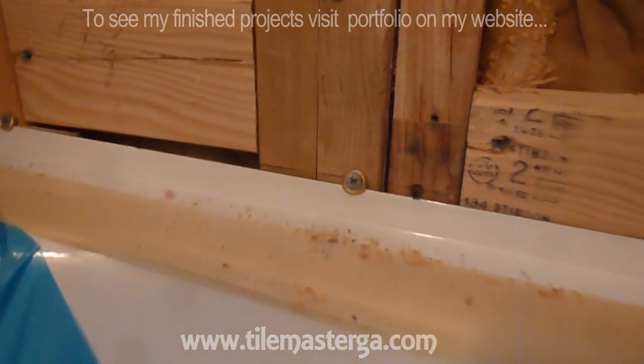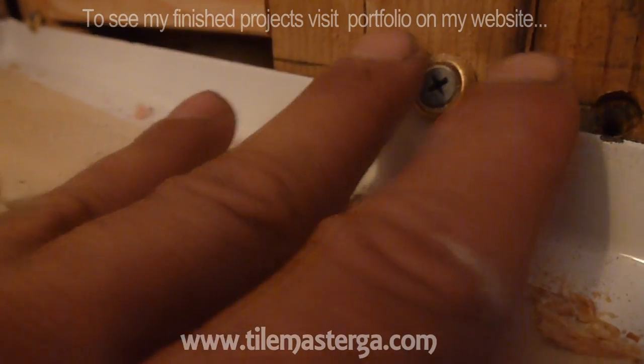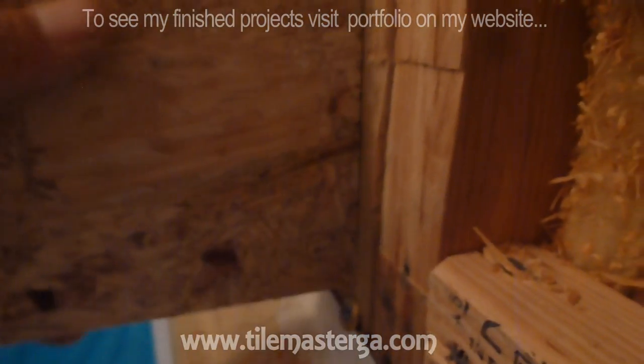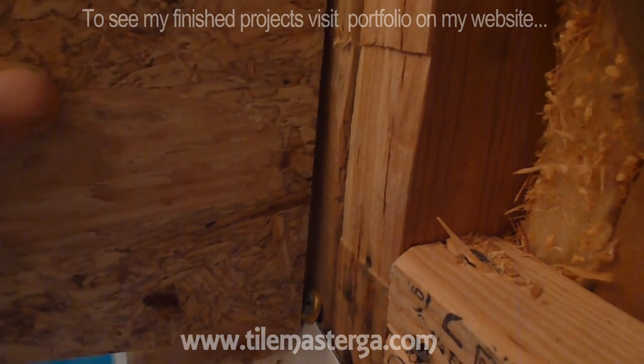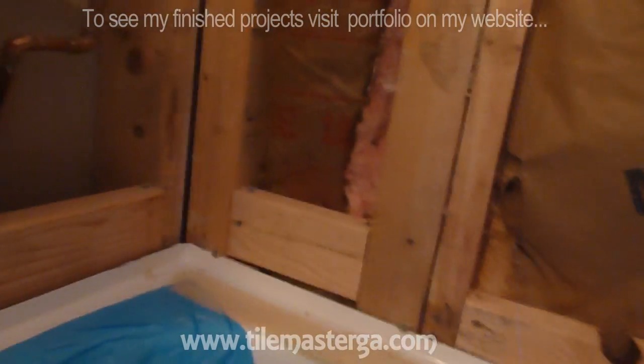So this is it. And another thing here, we've got those screws that secure the tub. Those will stay. I'm not going to remove those. What I will do is figure out where these screws appear on the board, and I'm going to notch the board a little bit from the back side where the screw appears, to have the board sit nicely flat on top of the studs. We're trying to avoid just putting the board on top of the screws or clips, depending on what you're using, because later we will have a crooked board. You see the gap? The goal is to have it like this, not like that. So I'm going to notch the board from behind slightly so it doesn't go on top of the screws.